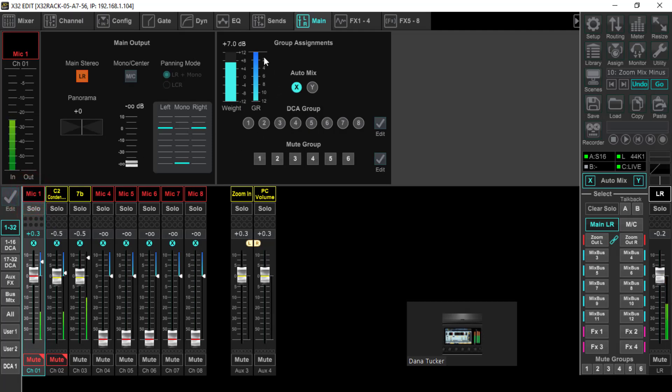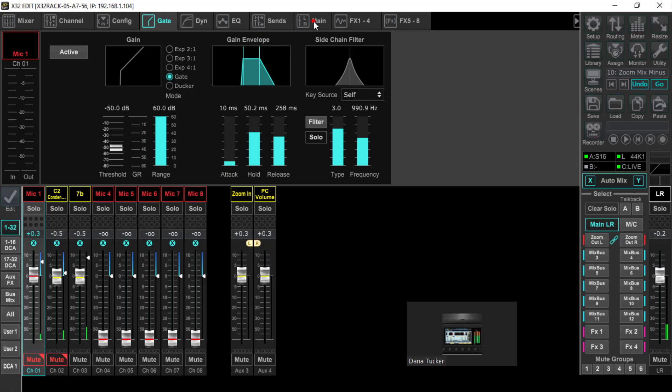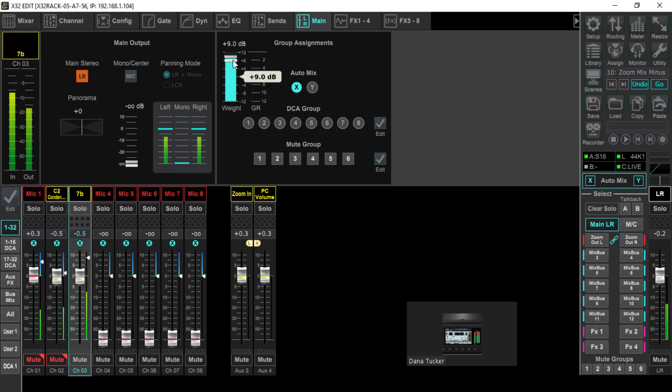As you can see, I've got channel one highlighted, and just like a gate would show, the gain reduction is down 12 dBs — that's what it's doing. With a gate you can reduce it down to negative 60 dBs; with the auto mix it's 12 dBs. When I come over here you can see it's coming up because I have it set to the priority — that's this right here, or you can do it right there in the mains. This goes to the primary speaker, which would probably be on mic number one input, and then you set the priorities. You'll have to play with this — I don't know your conference table or where your mics are. Always practice before you go live.